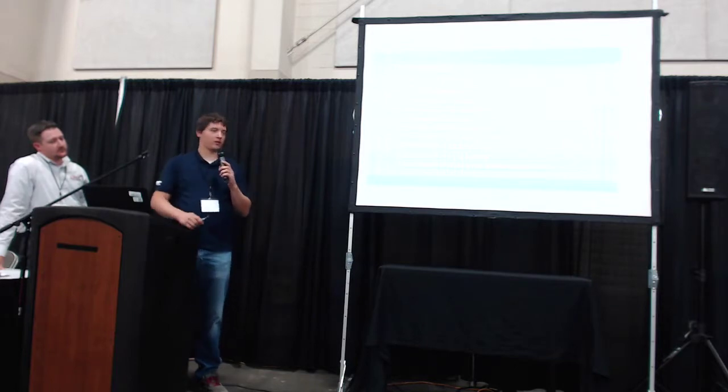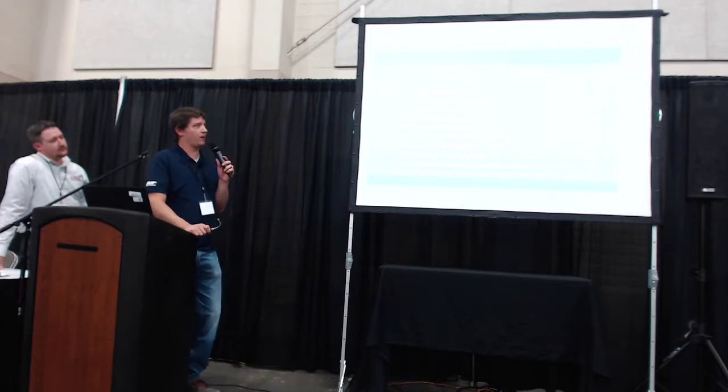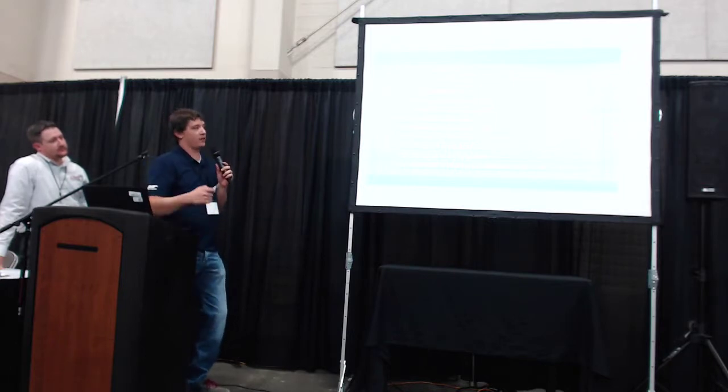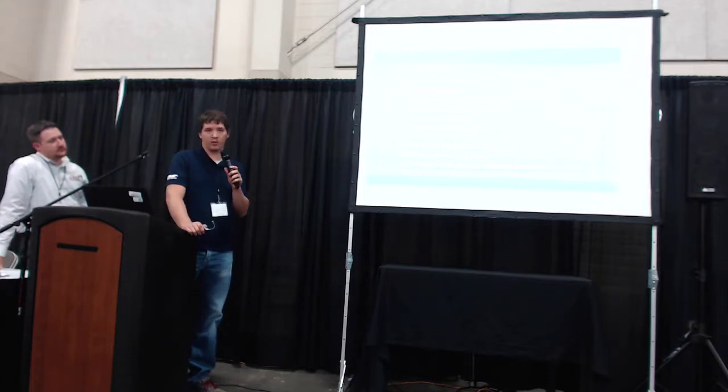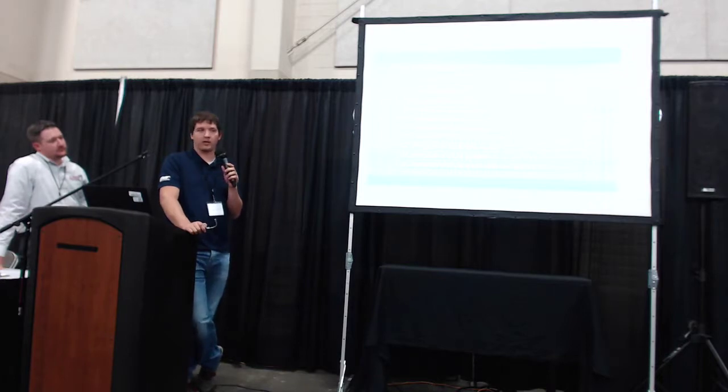So documentation. When it comes to an inspector, you're going to have a lot of documentation. You're going to have your daily comments or your diary, and here are some of the things that should be included in that. You've got your documentation of your paver actions. Was the paver stopping and starting a lot? That can be an issue sometimes. So if there's lots of starts and stops of the paver, you probably want to document that, so if there is an issue, you can bring it up.